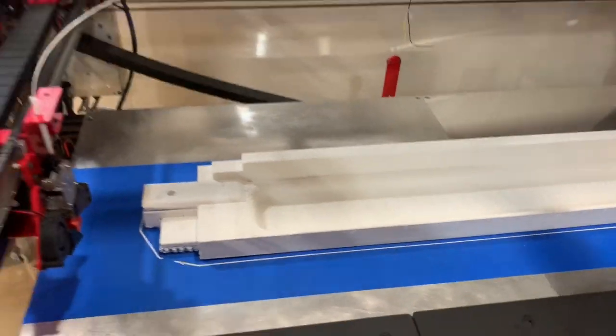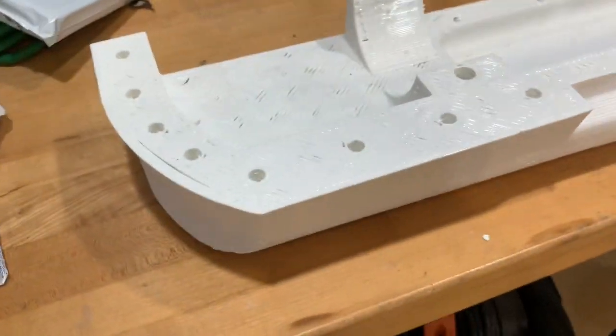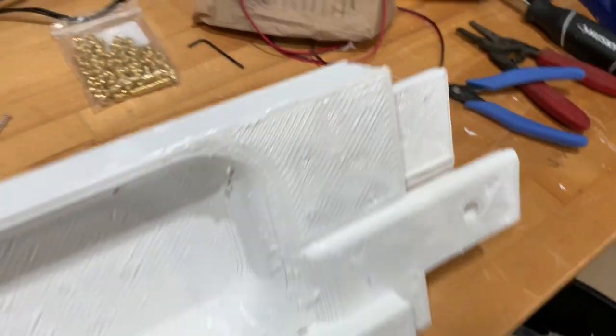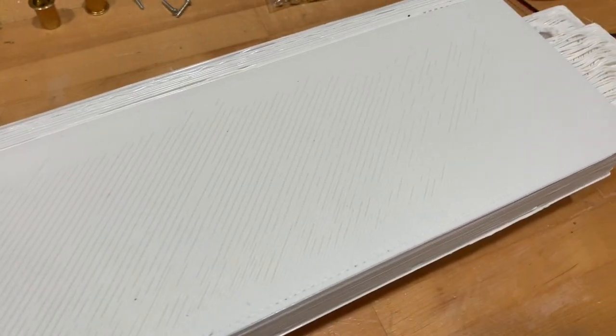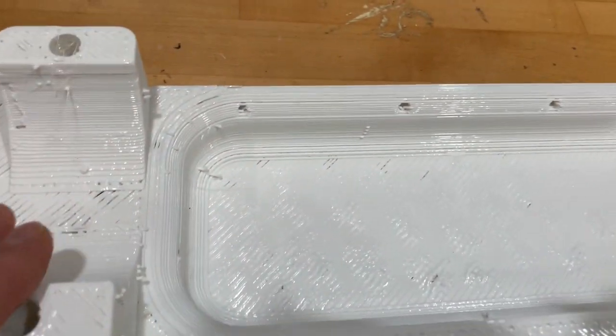So that's my biggest print so far with my Modix Big 120. The piece is coming off upside down. Next time I do this, one thing to consider on this big machine is printing it sideways for better results. I've done that before, but I was trying to minimize support material. This side came out fine. The top — which is what was on the tape — isn't too bad. You can see the lines from the 1.2 millimeter nozzle, but I can fill those in pretty easily. The sides came out fine. On the bottom side, I added an inset to reduce material, and you can see those lines, but again, a lot of that I can fill in.